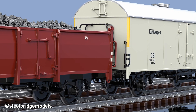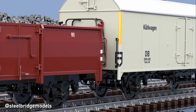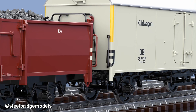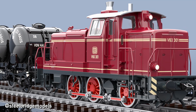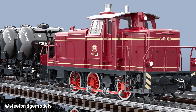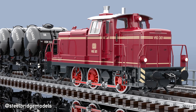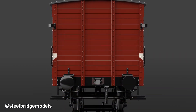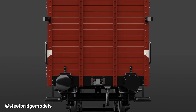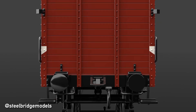Piped, a standard goods brake, or a non-standard one — so far so good. But all three of these markings also come in a variant where the lower side of the bottom square is pulled down forming a triangular point. This variant always indicates a goods wagon that can be used in passenger trains. For the braked wagons with either two or three squares, that translates to their air brakes being adjustable for use in either goods or passenger trains, still divided into standard and non-standard brakes. For piped-only wagons however, it's a bit more complicated. You can't adjust a non-existing brake for use in passenger trains. Therefore, a wagon with a single pointed square — which isn't a square anymore — is only equipped with a dedicated airbrake for passenger trains, but none for goods trains. Those wagons could be freely used internationally, but for use in goods trains their brake had to be disconnected from the pipe.